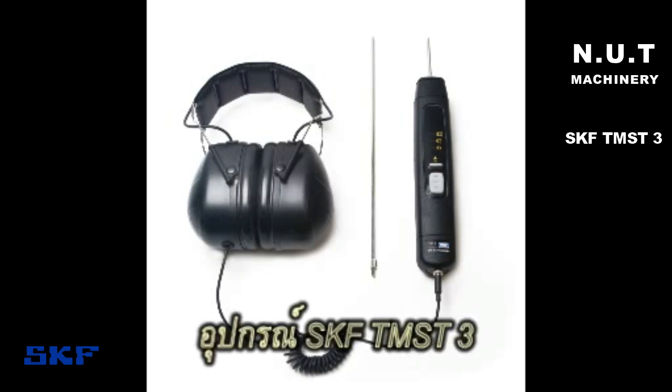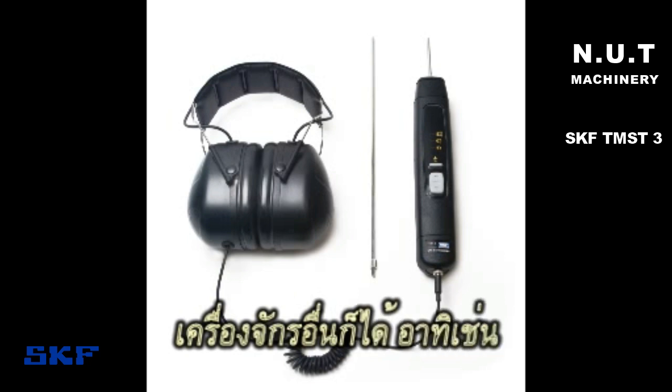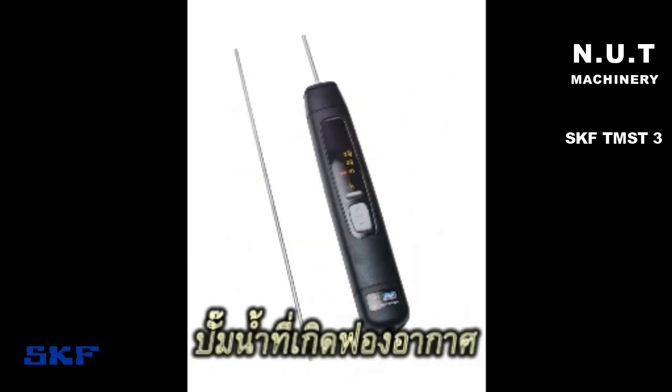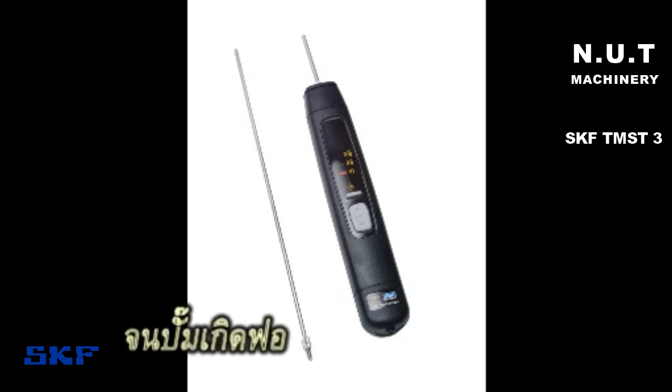The SKF electronic stethoscope may be used to monitor the condition of objects other than bearings too. Take, for instance, cavitating pumps. The relationship between the head and flow rate of a pump with a channel impeller has been changed in operation until the cavitation has started.